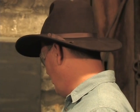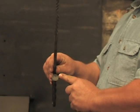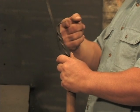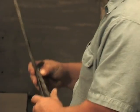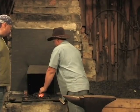So Jason, what kind of handle do you want to put on this dipper tonight? Well, I thought this time we'd do a little bit different handle — we're going to do a jelly roll tonight. Basically, instead of making a finger guard like on the other tools, since we're using quarter-inch stock it's a little smaller, too small to make a fan tail or fish tail. So we thought we'd just do a jelly roll, which is spreading the metal out a little bit, flattening it, and then rolling it over. It'll look similar to a jelly roll — hence the name.